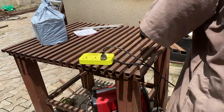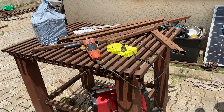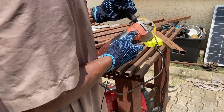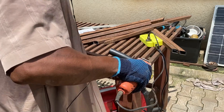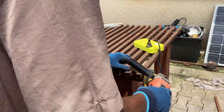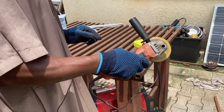After cutting with the cut-off machine, you usually have rough edges on the pipes, so I use this angle grinder to smooth off the edges so that they can align properly before welding. We'll be smoothing all the surfaces for welding. And that's the edges done.